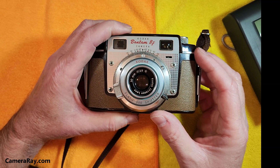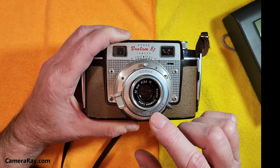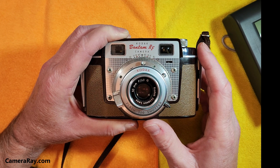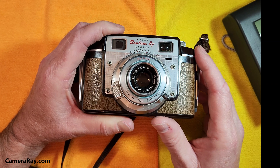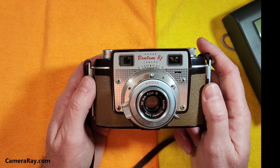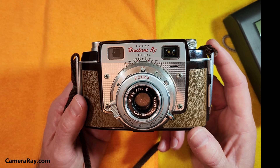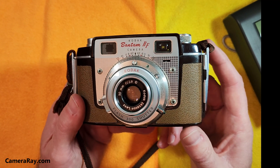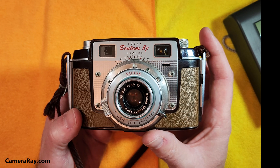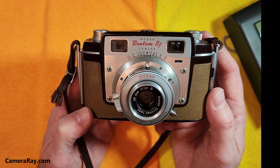That brown tint can be removed by putting the lens in the sun to let UV light hit it, or by holding a UV lamp over it for three or four days, which will lighten it up. Leaving it in a window for about a week does the same thing. This is just one of the few Kodak cameras that was radioactive — a lot of the Takumar lenses with thorium were produced more in the 60s and 70s, and there really weren't many putting thorium in lenses in the early to mid 50s, making this one of the few exceptions.